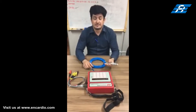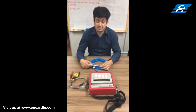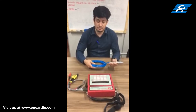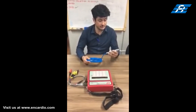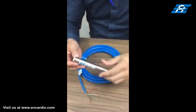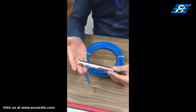In this video we will talk about the vibrating wire piezometer. This is an Encardio model EPP 40V slim size piezometer, specially designed for monitoring pore water pressure. The vibrating wire piezometer consists of a magnetic high tensile strength stretched wire, one end of which is fixed to the sensor body and the other end is fixed to a diaphragm that deflects in proportion to applied pressure.